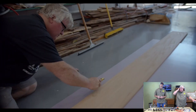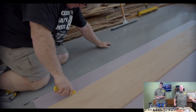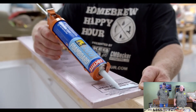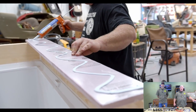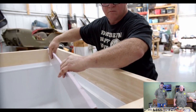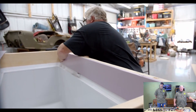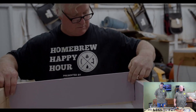Now I'm cutting insulation — I use foam board this time. I've never used it on a keezer build before, and I will never build another one without it. It made all the difference in the world. I'm getting so much better insulation now rather than just counting on the board, since boards don't have great insulating quality. That extra bit of insulation also helps the compressor load tremendously, so it's not cycling as hard. I did a pattern where I'm trying to get as much coverage as I can. I used quite a few clamps and in the end it made a huge difference. I beveled the edges on the inside when I was done, and I was a little worried the foam might pull off when I started sanding, but it was very tight so I didn't have any problem.